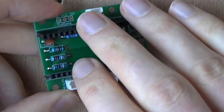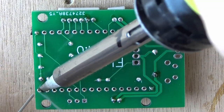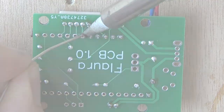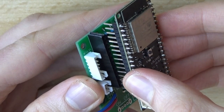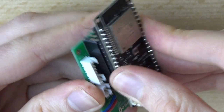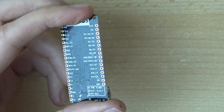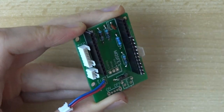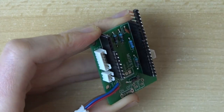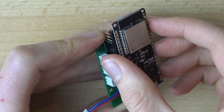After that, repeat the same process with the female pin headers. It's very important to solder them in an upright position so that later the pins of the ESP32 will fit in nicely. ESP32 boards are usually delivered without pins soldered on in order to avoid transport damage. In this case it makes sense to plug the male pin headers into the female ones of the PCB and then place the microcontroller on top to keep everything in place while soldering.